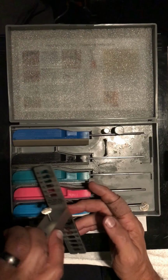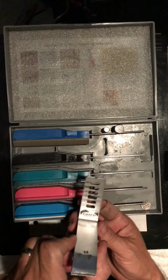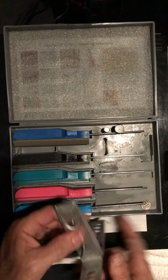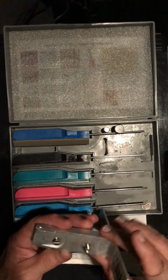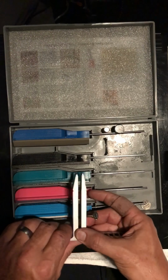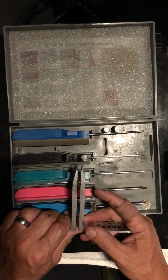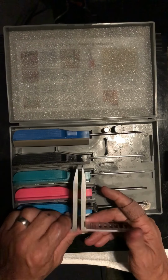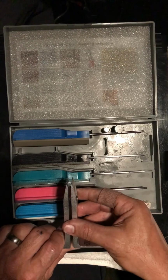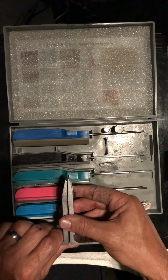I've been using this jig for many hundreds of knives, so you can see it's kind of worn and used. On the edge, I get really shallow. It's worn off sometimes right here. I'm currently sharpening a knife that I'm making a special order for someone, a handmade, completely homemade knife. So it's a 1/4 inch thick. So I've got the jig set on the big step right here for holding the thicker knife. Most of your knives, 3/32, 1/8 down there, will be much shallower.